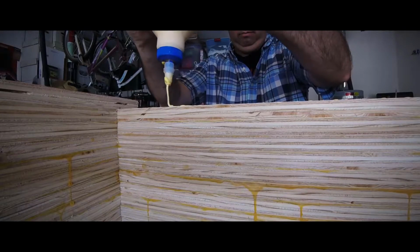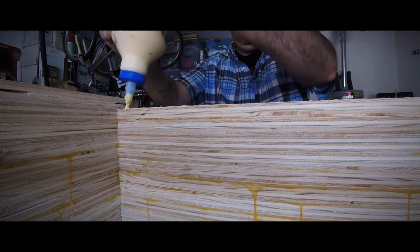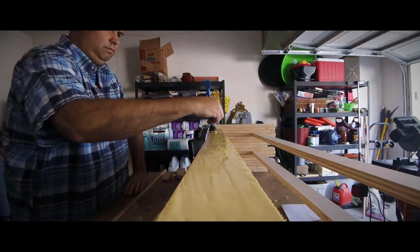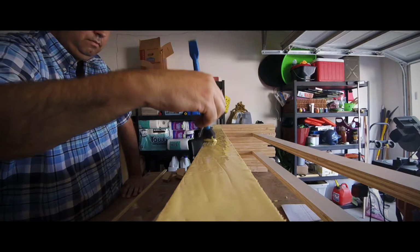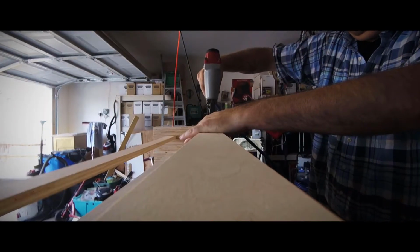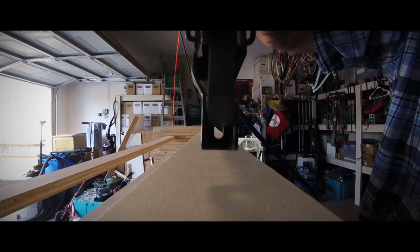It was put together on its side, and the strips were laminated together with ample amounts of glue. I also used brad nails to hold the strips together while the glue cured. I progressed steadily, following my plans and inserting the stretchers into the appropriate places during the assembly.